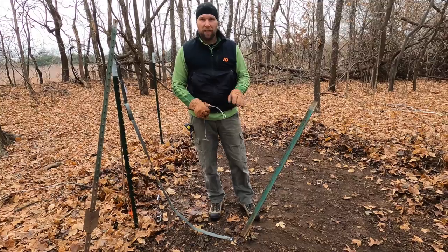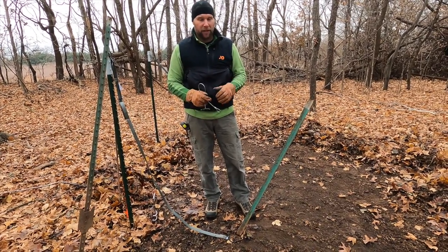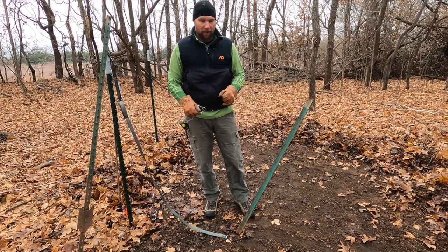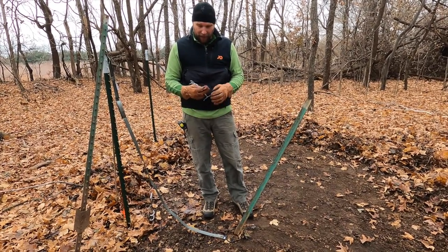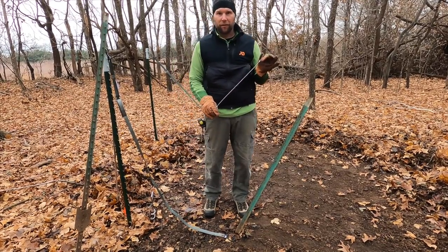One of those occasions would be if you're working in highly organic soils that are kind of loose. What would come to mind is if you're in the river bottom where you have a high amount of organic matter and the soil density is very loose. This type of anchor probably will not work well for you and you should consider a different type of anchoring system.